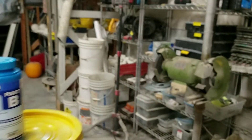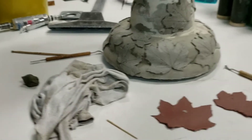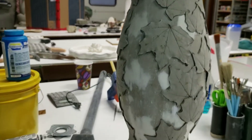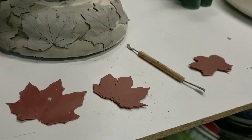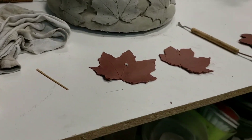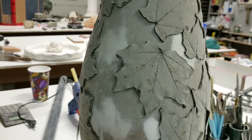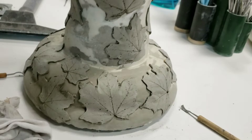Anyway, I'm going to move on quick — what I've got on the tables and what I'm going to be doing here. There are a few pieces brought back from the dead. This fellow here has probably been away four or five years. It's going to be a maple leaf pedestal. I'm missing a couple spots in here, and that's what these monster clay leaves are for — they're going to fill in those little spots. I'll be doing a video on how to do the leaves and how to apply them. The original piece was done with the applique method — actually putting concrete on a leaf, inverting it, and putting it on the pedestal. It's painstaking, it's a lot of work.